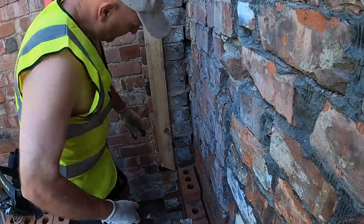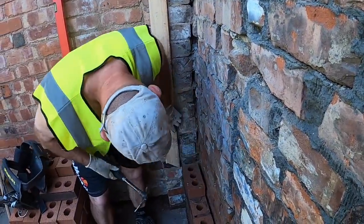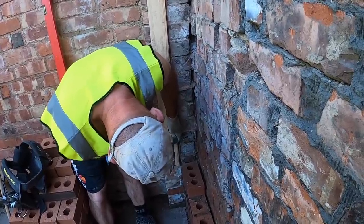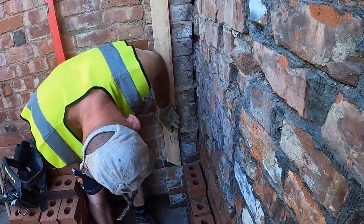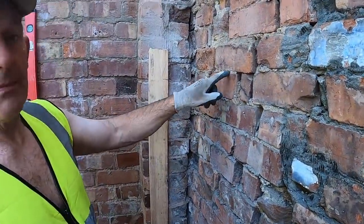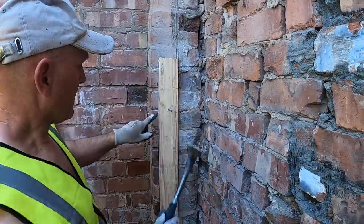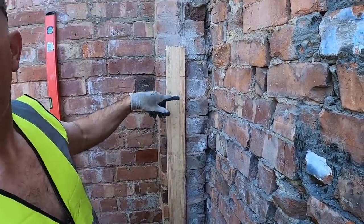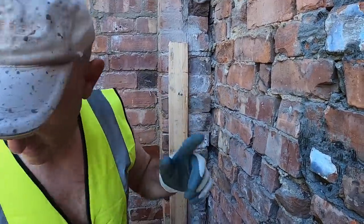That's not too bad actually already. A bit wavy. So this goes in. Pretty solid. I was using the big nails because I thought it was lime mortar, but this has been rebuilt. This is sand and cement. So normally we put masonry nails in there, so they don't do that. But that seems to be holding okay. So when you put your line up.